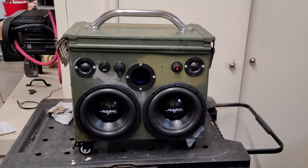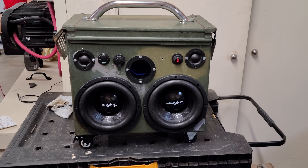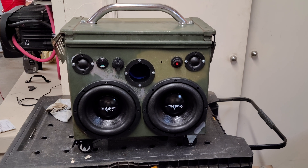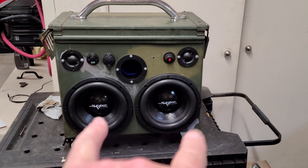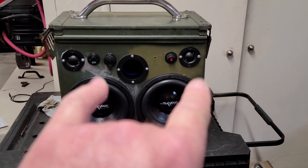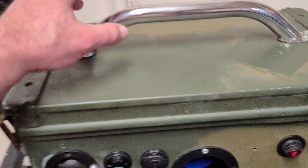I want to do a really quick video. I'm doing a speaker fitment and I got the big battery that I pulled out of my power pack to check for clearances behind the magnets on the two woofers. These are the ones I'm going to go with right here — these are the ix series. I got them loosely mounted with four screws and I got the tweeters mounted and the port in there. Let's take the lid off and I'll show you the inside.